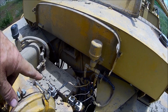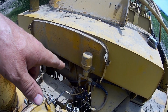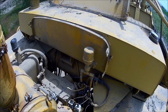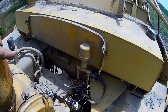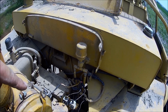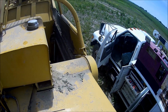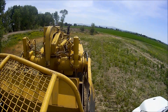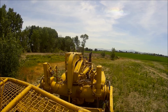We've replaced the wiring harness on the rear engine, the harness that goes up over the hitch, the main harness, the main harness under the dash, and then that comes back to that synchronization switch on the main transmission. So all we've got left to replace is the main harness through the bowl, and it goes up through the side of the bowl on the right side, comes out right up there and goes up under that hydraulic hose, and then around on the neck, and then up there you'll see another cannon plug.